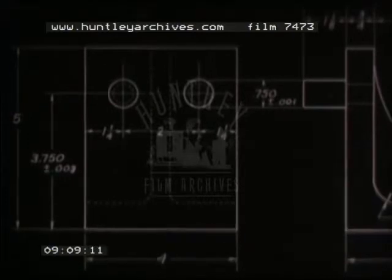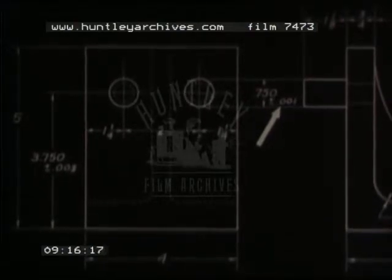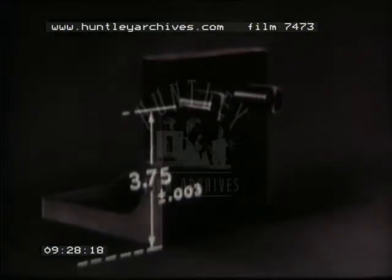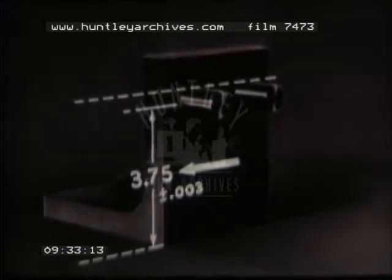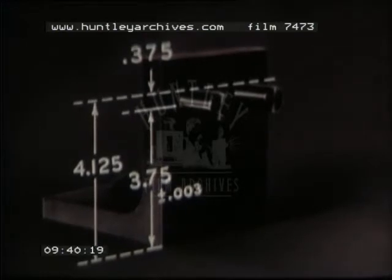A drawing of this fixture shows that the studs are .750 in diameter, plus or minus 1/1000th. The location of the center line through the studs is to be 3.750 plus or minus 3/1000. To check the height of the studs, set the Vernier height gauge to 3.750 plus half of the .750 diameter of the studs, which is .375, thus setting it to 4.125, the established measurement from the base to the top of the studs.